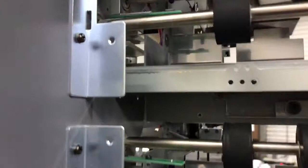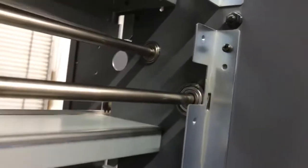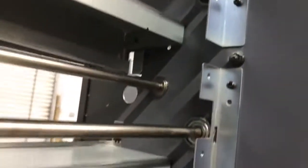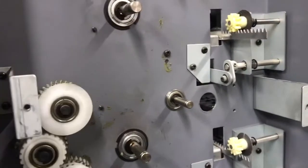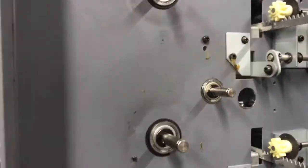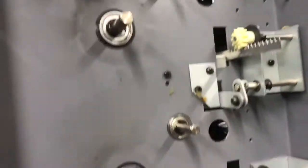We did a check with a stethoscope. That's how we can tell whether the bearings are noisy or they're bad. So any noisy bearings get replaced. But most of the bearings on this side were noisy, so we replaced them all. That's usually what we do. If we find over half or more of the bearings are bad, then we replace them all new. Sometimes that happens. We don't know why, but anyway, everything else looks pretty good.